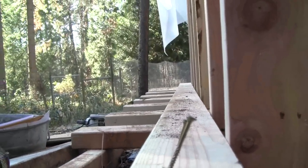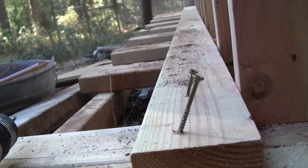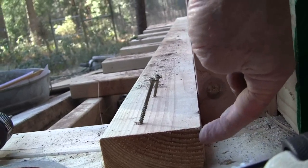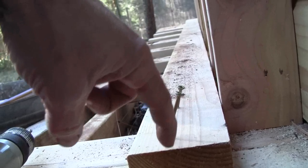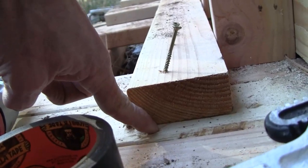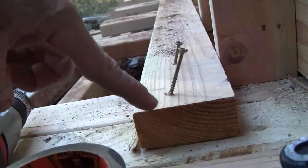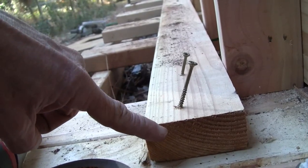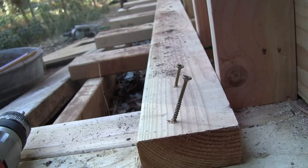There's a big difference in how you put the screws in. If you angle the screws, the force pushes on the board — imagine it as a slippery rod — the two-by-four wants to slide down but it can't, because it pushes against the plates underneath. That actually tightens the connection when force is applied. If you put the screws in vertically the other way, the force would want to tear the screw out of the bottom board.